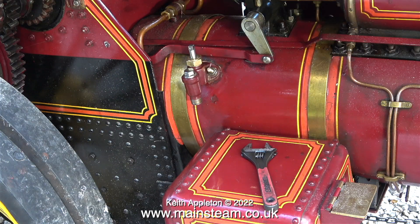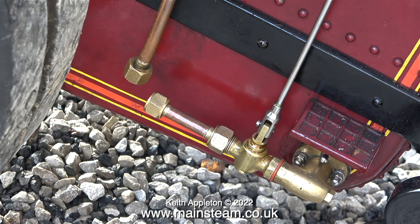To make it worse, the check valve is quite near the steam takeoff to the injector. When the number 8 injector starts to pump the water via the check valve into the boiler, it cools the steam that's been supplied to the injector, and I think this is what stops the injector from working.